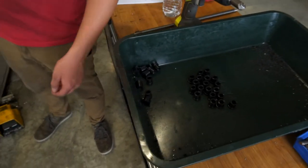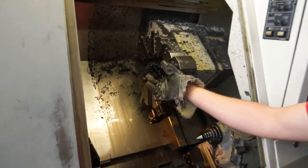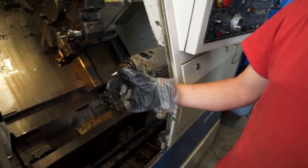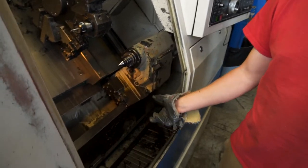I can dump them in here so they can dry. An important step for us when cutting plastics is we get a big bird's nest of chips on here — I have to pull this off. It's actually limiting the number of pieces we can cut in a cycle. With too much of this, it ends up getting caught up on the work and destroying it.